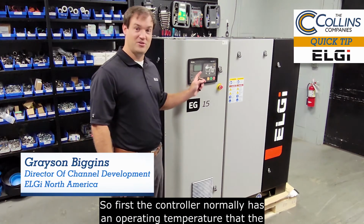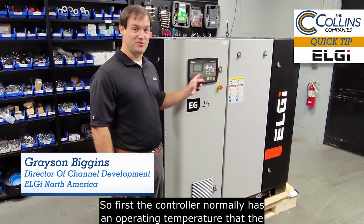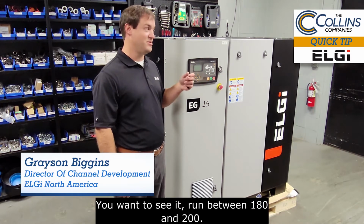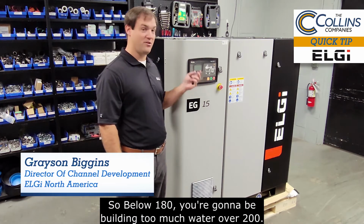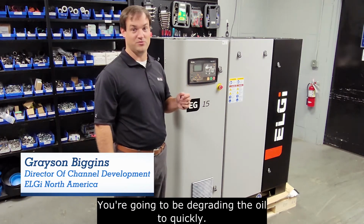So first, the controller normally has an operating temperature that the compressor is running at. You want to see it run between 180 and 200. So below 180, you're going to be building too much water. Over 200, you're going to be degrading the oil too quickly.